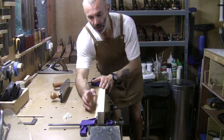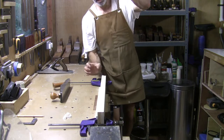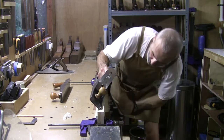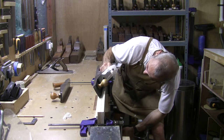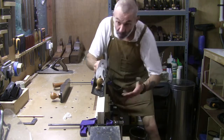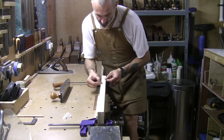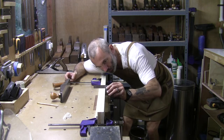So you may end up with two boards that do that or do that with a gap in the middle or a gap to the side. So in order to address that, in this case, for example, I take the edge of my jointer and then go across. Blimey, this is actually spot on. That's impressive. Okay, that's good. So now that I know that this is more or less flat, I really only need to address this line here and then keep checking with reference like that.